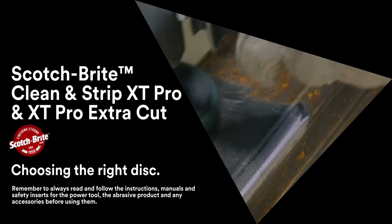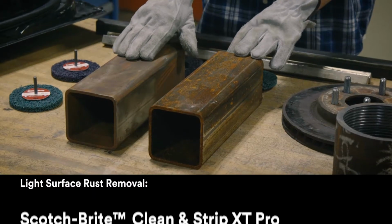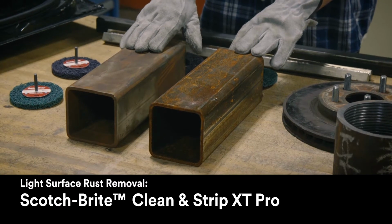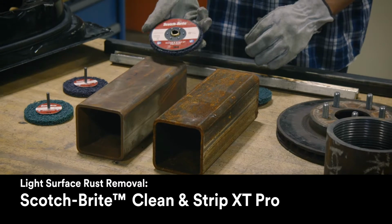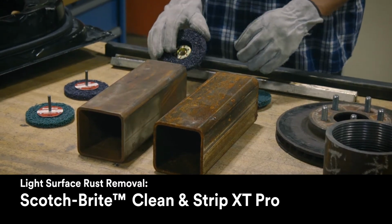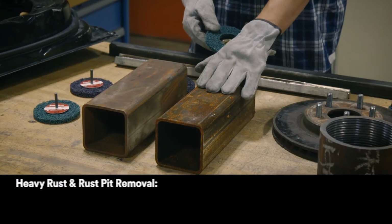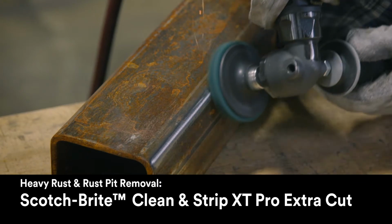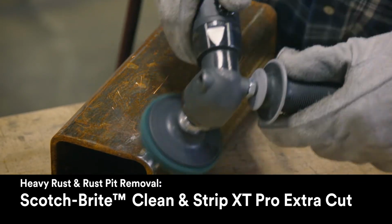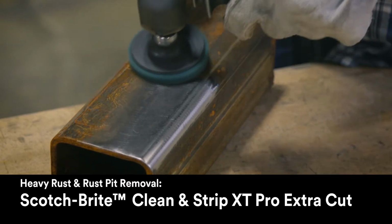So here I want to walk through the two different types of rust I have laid out here. This one is what I would consider a light surface rust, and the silicon carbide version, XT Pro, works great for removing surface rust without damaging the metal underneath. If your part has thick rust and some deep rust pits, you're going to want to use the Extra Cut version in order to remove that rust and then also smooth out those rust pits underneath.